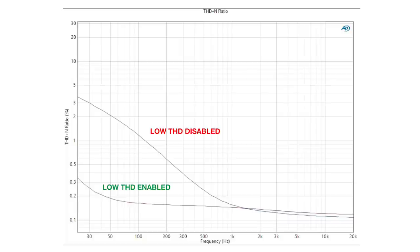Now, let's take a look at the low THD button, which is another useful sonic option to have at your disposal. Most compressors by their nature start distorting low frequencies before high ones, particularly when set to fast release times. Sometimes this forms part of the desirable analog character, but other times it can be counterproductive. Pressing the low THD button on the Bus Plus introduces a special circuit modification in the sidechain, which helps to limit the amount of low frequency distortion created.